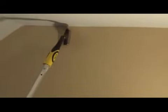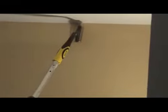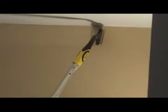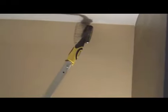You have the top here at the same time and you can use it sideways on this type of angle. If you get a wide band, you get about a 4 to 5 inch band of cut, and this allows you to roll easily to that cut line without touching the ceiling when you are rolling. So this gives you a nice straight line again, as you can see.